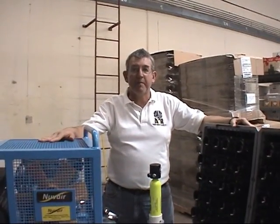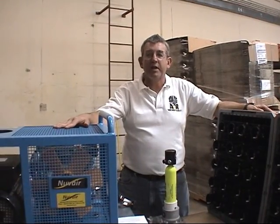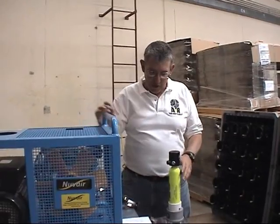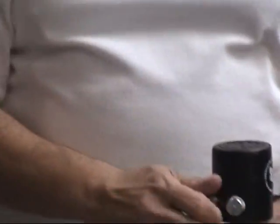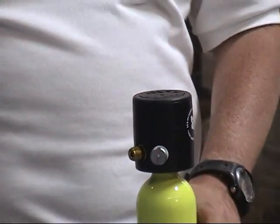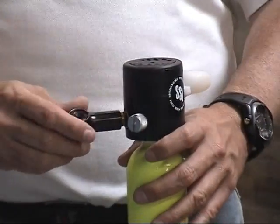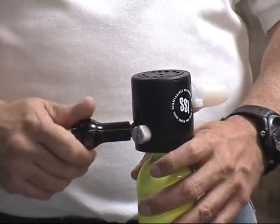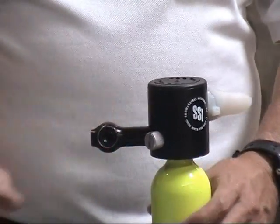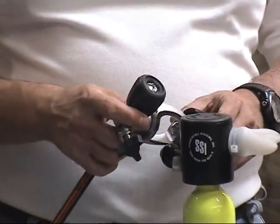Spare units are shipped empty and must be filled prior to use. I will be referring to Section 5 of the manual. Step 1. Unscrew the check valve from the fill port. Step 2. Take the 920C refill adapter and attach it to the fill port. Just barely finger tight. Step 3. Take the yoke from the compressor unit and attach it to the refill adapter.